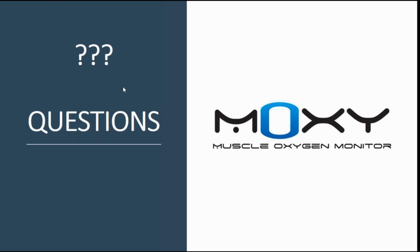One more question. Do we need the higher hertz of the Bluetooth? No. Bluetooth in some cases could have a higher communication rate, but there's really no need for that. Even at the highest update rate for the Moxy, it'll update 2 times per second. ANT updates 4 times per second, so we still aren't exceeding the ANT update rate. And even if we were to go faster, we'd still have room. There are ways we could go even faster with ANT. So there are really no limitations for update rate as far as the communications are concerned.